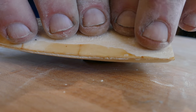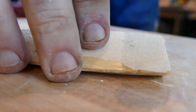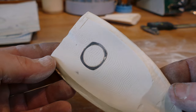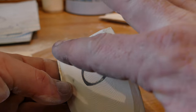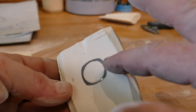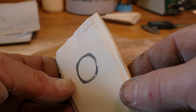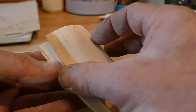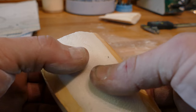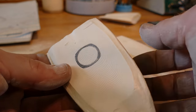Press down — oh yeah, there we go. It went in really nice. You can see it's pressed all the way into the cuttlebone, which is exactly what I want. Wherever the mold joint comes together, we're going to have a line right there. I just don't want that in the middle of my ring, so we can put it on the end and totally get rid of it. Once we have it nicely pressed in, take your other cuttlebone — that'll fit really nice. We'll take this out and cut our sprue in.